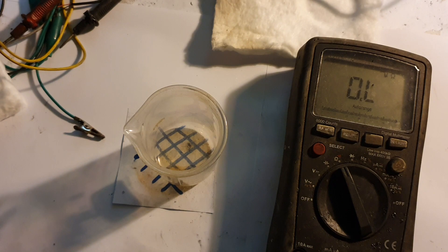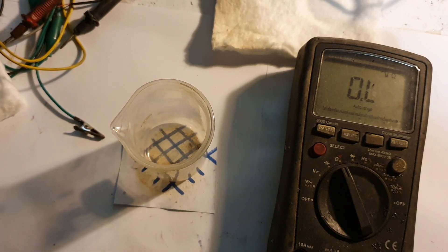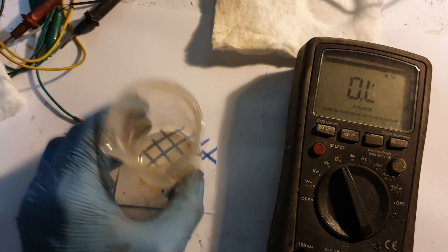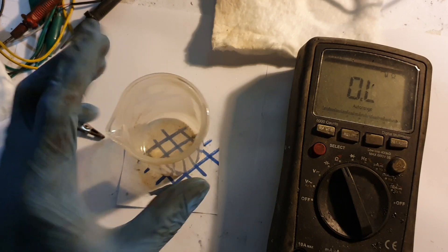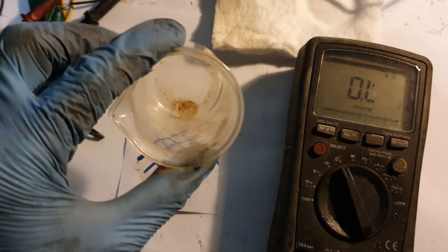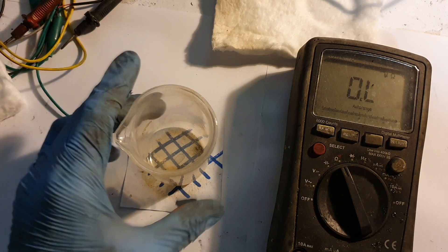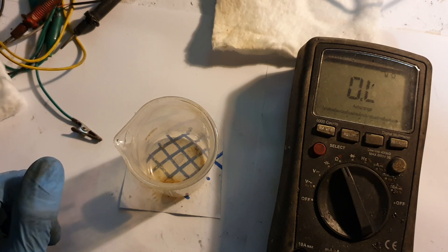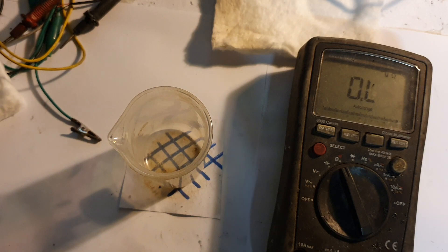I will show you a transparent conductive glass sample made with the beaker. I sprayed it with the tin chloride solution made before, but I put this beaker in a laboratory kiln at a temperature of 650 degrees C and sprayed four to five times. I heated the beaker in the laboratory oven to 650 degrees C, then took it out, sprayed with the tin chloride solution, then put it back into the kiln. I repeated this process four times.